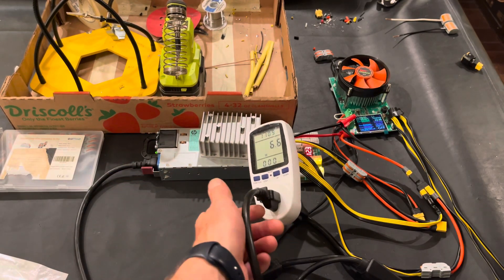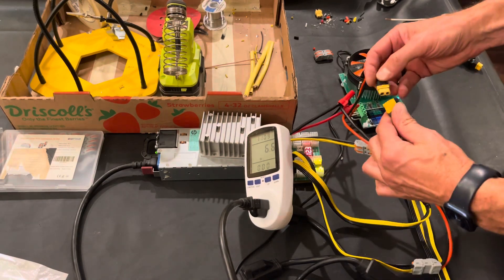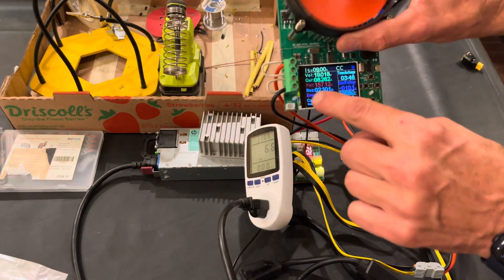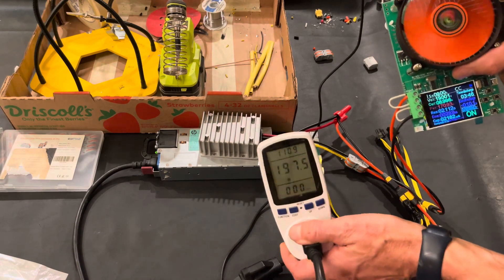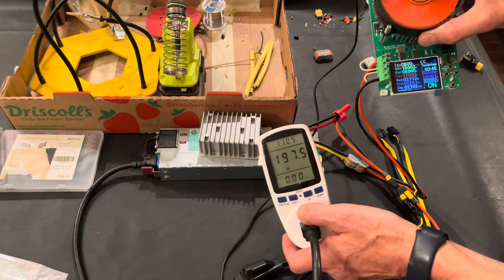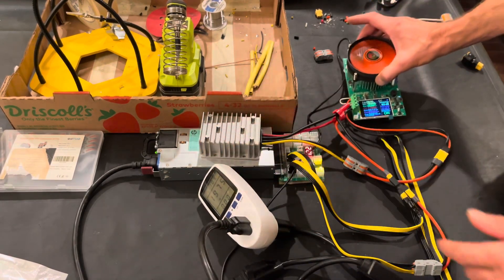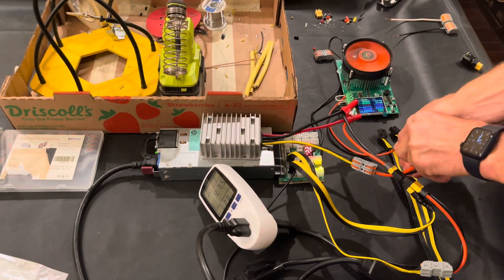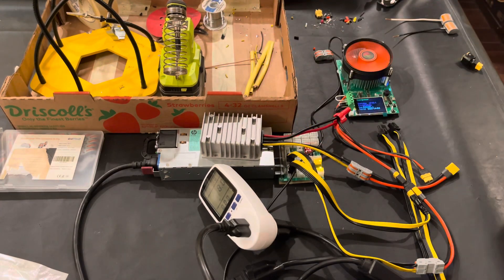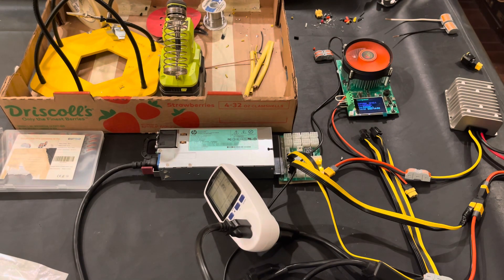I want to show you the full load one more time. At 19 volts output, loading to 170 watts — on 110 volts wall power we're actually pulling 197 watts from the wall. So we're losing about 26 watts to efficiency losses across both devices. On a 100-240 volt system the performance is a little better, so I recommend using 240 volts for better efficiency. You need 1200 watts to safely connect up to eight devices. Hope this helps — thanks for watching, see you in the next one.